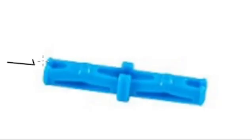One part that may break due to excessive stress is pins. As you might have seen through the construction of the robots, there are many joints and parts that are connected by pins. Pins can break due to an excessive force that is applied over the small area of the pin, and can also break due to misplacement of the part, such as a mechanical defect of the pin.